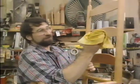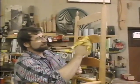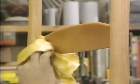For the finish on the chair, I'm using a Danish finish. I just rub it into the wood, leaving the natural wood show through. And with this product, I can put on a coat about every 30 minutes. What I really like about it is that it's non-toxic and that I can clean up with just water.